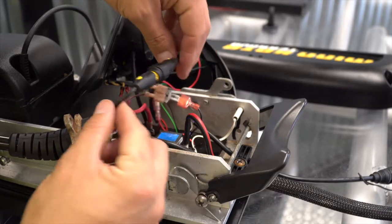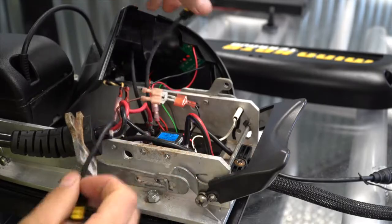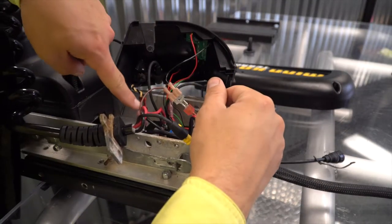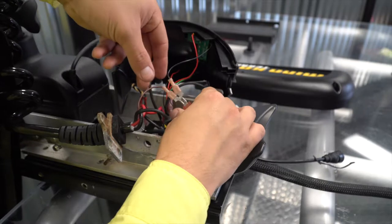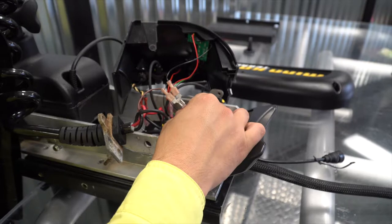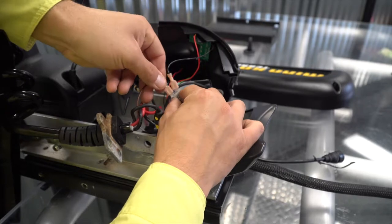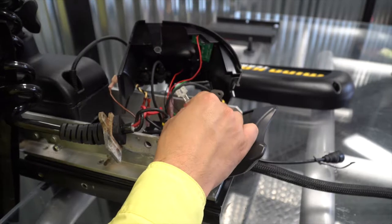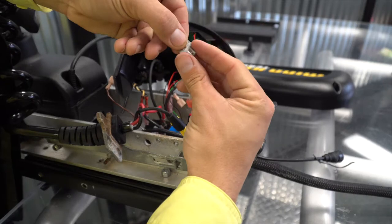If you have the plug for the co-pilot or the autopilot accessories, I'm going to disconnect that. I've got the voltage meter sensor coming in here and the universal sonar ground — if you have these both, you'll disconnect them. Note that often times this connection will be covered in heat shrink and you'll just need to cut off the old heat shrink and discard that. So here I'll remove the universal sonar connection and the voltage meter ground. And if you have this double spade piece, remove that and set it aside — we'll need this for later.